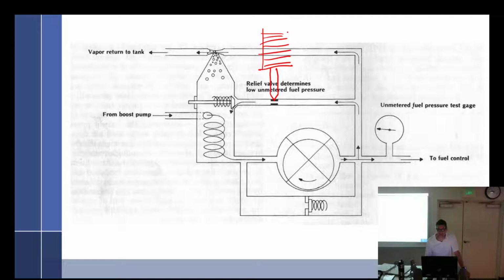Bellows. Potato chip bag. Tater chip. And the reason why you would do this is what? Altitude, it's going to restrict your fuel flow. So if I go up in altitude, this will expand, and it's going to press down here and make this smaller. Yep. Restricting the fuel, back to the pump, which sends more to the engine, and it gets richer.